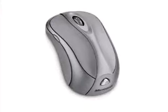We're going to see wireless mice. Wireless mice, everyone's using them. There's some Bluetooth ones, but the majority of them are RF. And as I'll show you later, there's no encryption. There's nothing going over the air to authenticate them. So replay attacks can happen. Injection attacks can happen. This is very rudimentary type stuff, and getting access to the point of injection and the point to sniff is not that difficult.